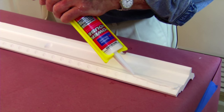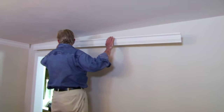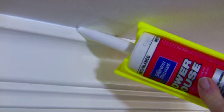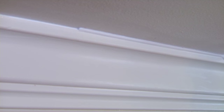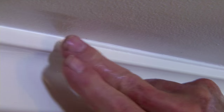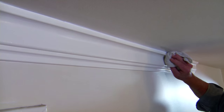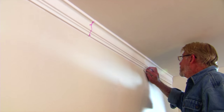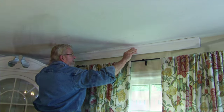The second method is to place the bead of sealant about a quarter inch away from the edge, set the molding in position, and press firmly with the palm of my hand. In this case, none of the sealant squeezes out, and an additional bead of caulk is added where the molding meets the ceiling and wall. I remove the excess with my finger and clean away any remaining material with a damp cloth, stopping occasionally to rinse and wring out the cloth.